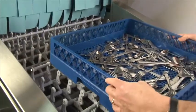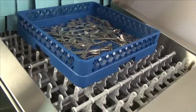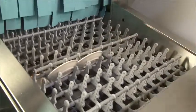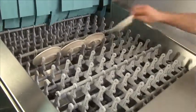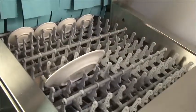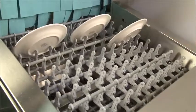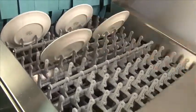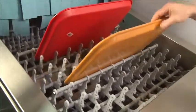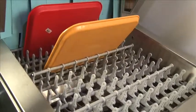When loading, place the racks directly on the belt before the electric eyes, and the electric eyes will pick up the rack. For loading plates, put the plates directly onto the belt itself in between each finger. We like to have good spacing between the plates so you'll get the best results from the water. You can also load trays directly into the dishwasher — extra spacing is recommended between the trays so we can get the best water coverage on each one.